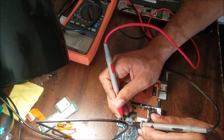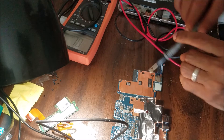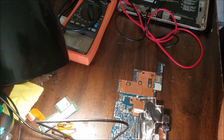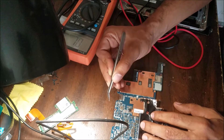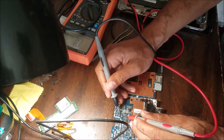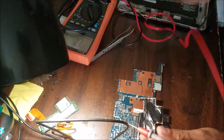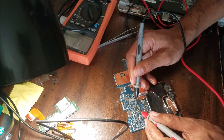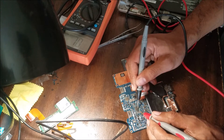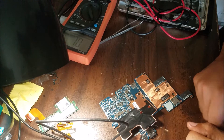This capacitor is just sitting loosely — you can see it is moving. Let me take the capacitor out and show you under the microscope. That's the shattered capacitor — there's no capacitor left in that place. This MOSFET here has a short in it, but the one next to it has no short. So let's check it more and see if we can fix it.